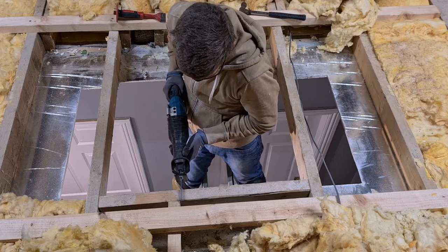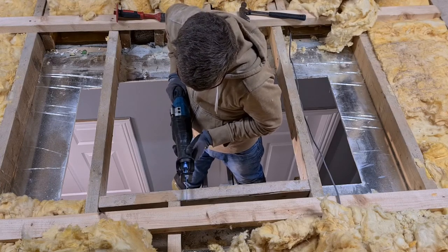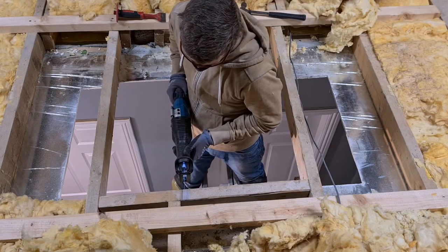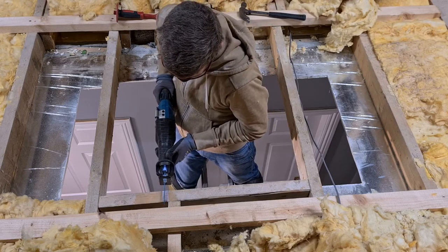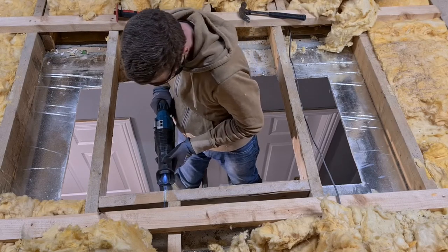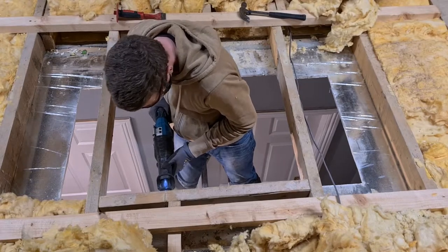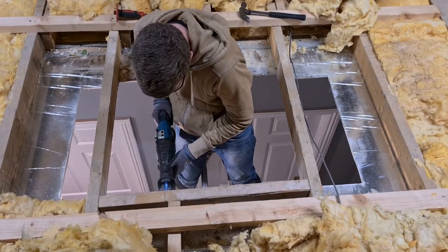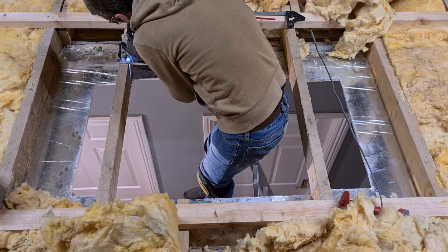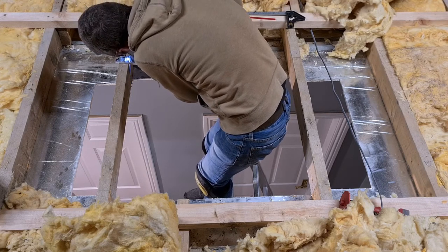Next, I remove the existing joists with a reciprocating saw. I measure and mark the joists that need to be cut. The circular saw cuts half the joists initially, and the reciprocating saw cuts the remainder. You want to cut the joist square, that is why the circular saw is used initially. Alternatively, a handsaw tool can be used. Use a hammer to remove nails from the joist where possible.